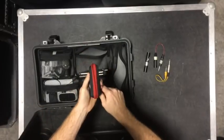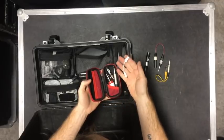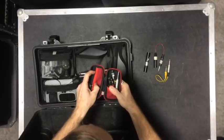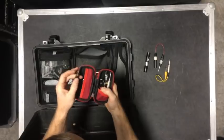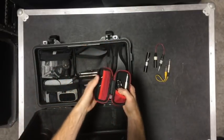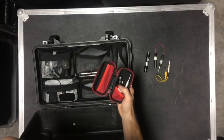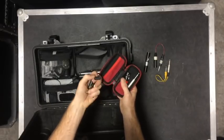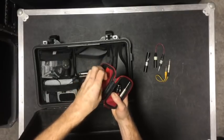I've got some little adapters in here. I've got a Lightning to eighth-inch adapter because I want to play music off my phone but no one brings the adapter. I have quarter-inch to RCA — that's unbalanced TS. There's a quarter-inch TRS to eighth-inch. These are great for headphone adapters — you can get those in bulk because they never come back when you loan one out.